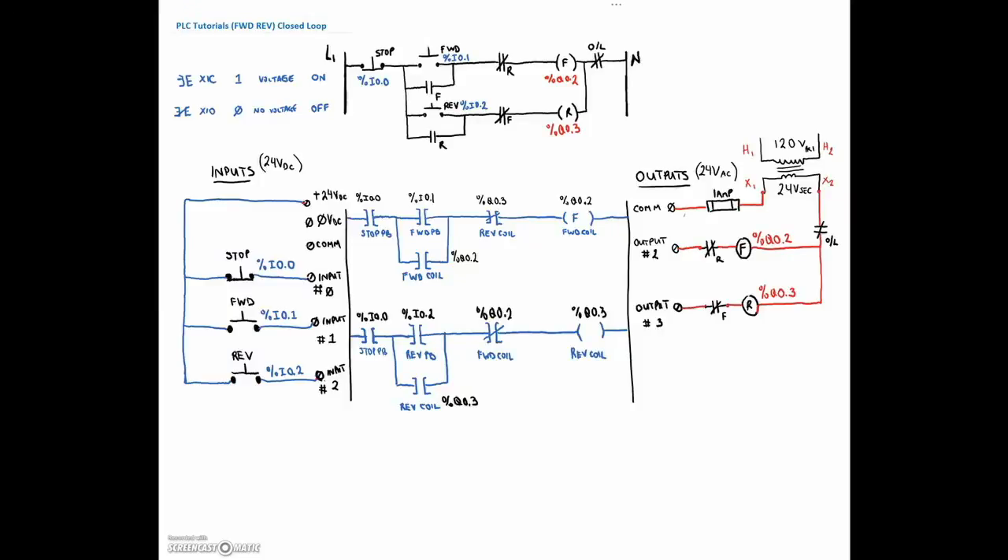In the previous video, we were doing the forward-reverse contactor, but we did the open loop - we were just looking at the output of the actual bit in the PLC and using that as our holding contact to keep our reverse coil on. The problem was that we didn't see anything out in the field. We couldn't see whether the contactor had actually pulled in, and we also didn't have anything on the overload. The normally closed contact could kick out our forward-reverse coils, but we didn't have a signal to tell the PLC that an overload had occurred. So we need a number of different inputs in order to create that closed loop.